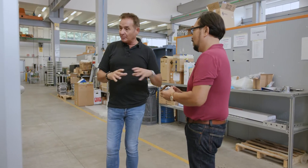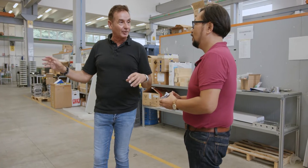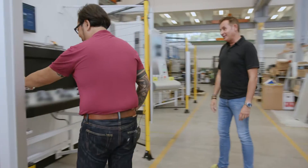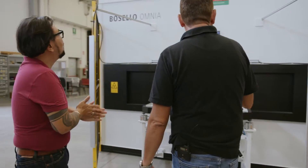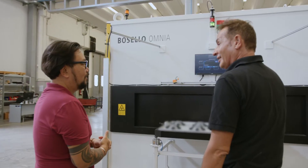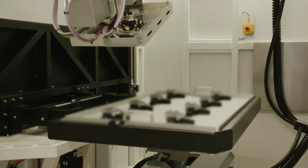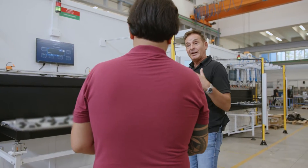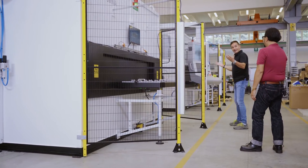When we have some parts, we develop the right fixture and the right solution with the pallet concept. You can put them in — eight parts now on the pallet. Now we will rotate the pallet and put it inside, and there is another pallet outside. So during the inspection inside by X-ray, you have time to load or unload parts outside. It can be done manually or automatically by robot. I will show you one cycle.